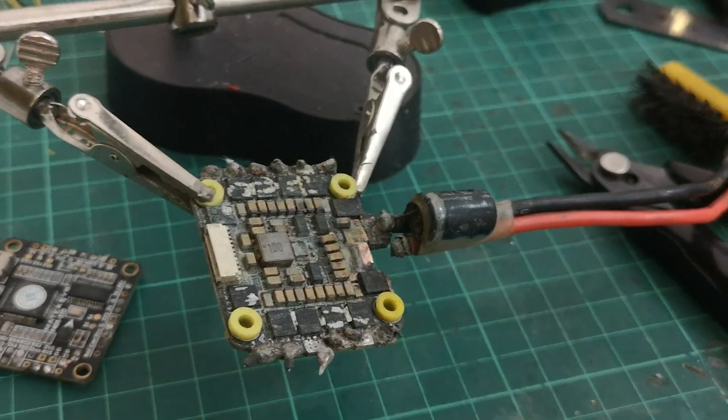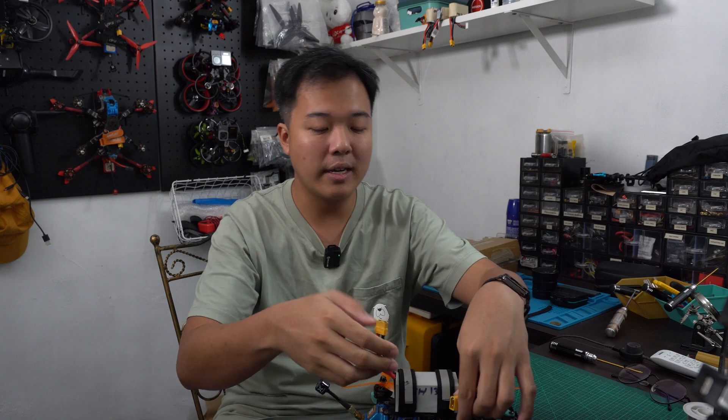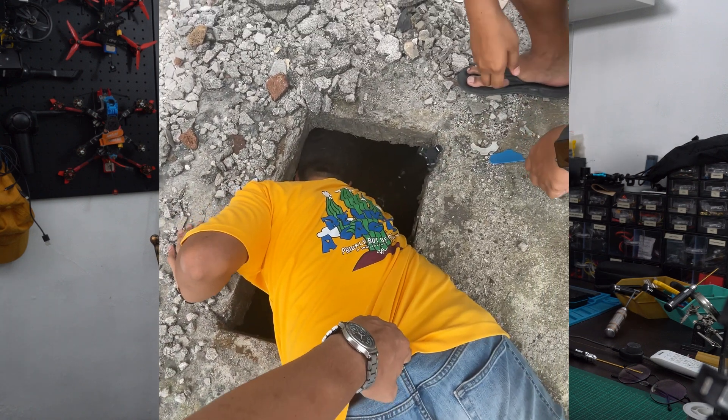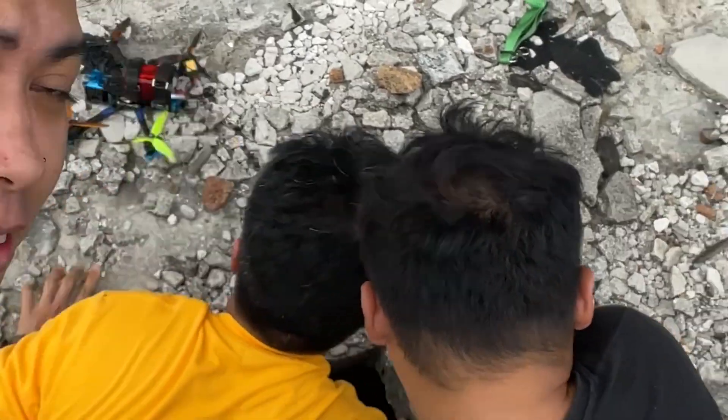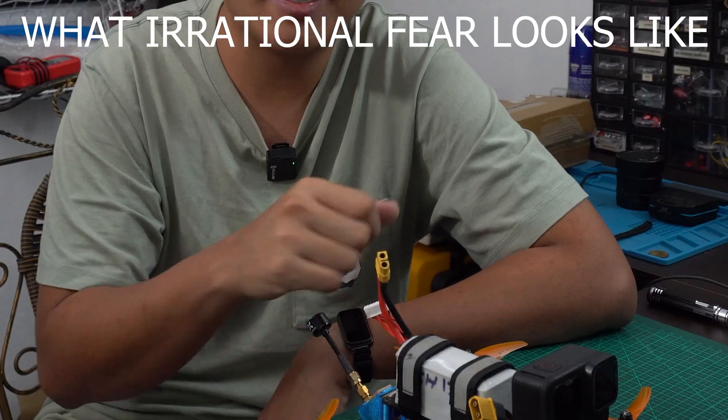What was happening is the power is still pushing towards the positive and ground leads, so it was short-circuiting like crazy. The only reason the fire stopped is because the plus pad of the ESC had been completely burnt out. From then on, whenever I did quad recovery underwater, I make sure to reach into the water while it's still submerged, unplug the XT60 before pulling it out. That's also anecdotal proof that you don't have to worry about being electrocuted by touching the leads of your quad or reaching your hand underwater.